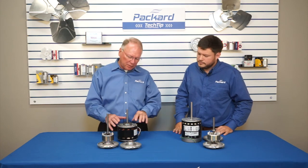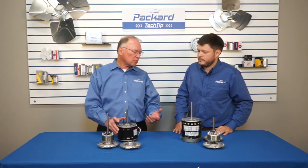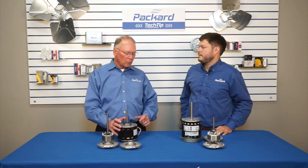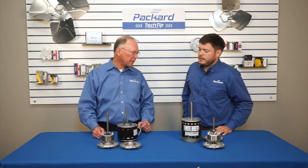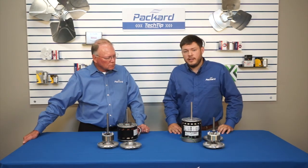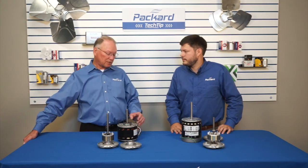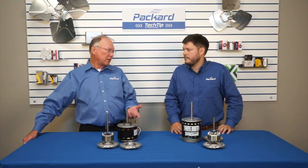If I have an application with a lot of dust and dirt — say a customer whose furnace is out in their garage and they don't change their filters — would it make a difference if I used a sleeve bearing motor versus a ball bearing? A ball bearing is going to be ideal for that application. As we said, the ball bearings are permanently sealed. The wicking in a sleeve bearing motor often picks up that dust and dirt, dries out the wick, pulls moisture away from your sleeve bearing, which adds friction and shortens the life of your motor. So if a customer sees a lot of motor failures in a dusty, dirty environment and they're using sleeve bearing replacement motors, it might be a great opportunity to switch to a ball bearing.